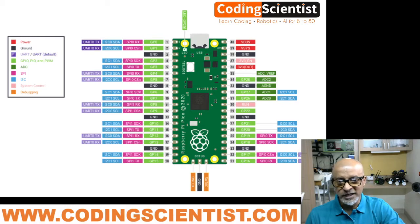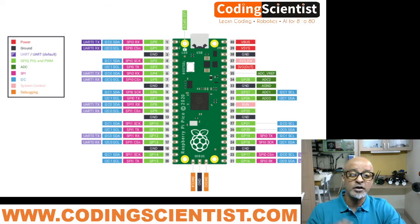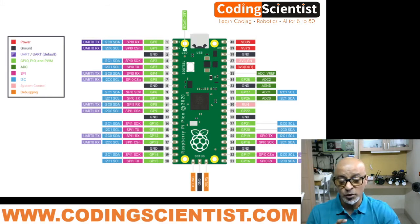Can you see all these green marks? That is what we will be referring to in the Python program, in the MicroPython code. When you give a command as an output or an input from the sensor, you need to use these pin numbers: GP0, GP1, 2, 3. So basically GP4 is the physical pin 6.